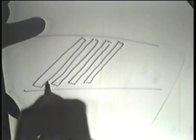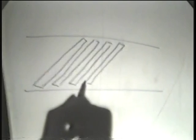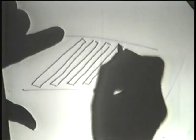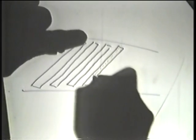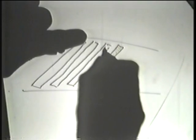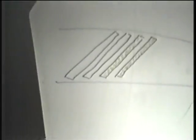And we have the double azimuth recording in order to cancel crosstalk and all that sort of thing, and we know all about that and how that works and so on. And all of a sudden now they're telling us, well, we're going to make a narrower head so that it doesn't cover the full amount of the recording. It's narrower than a normal recording would be, so as to allow a space.